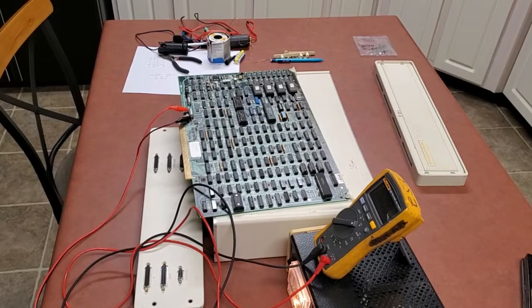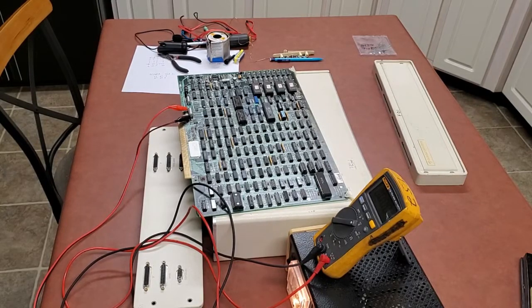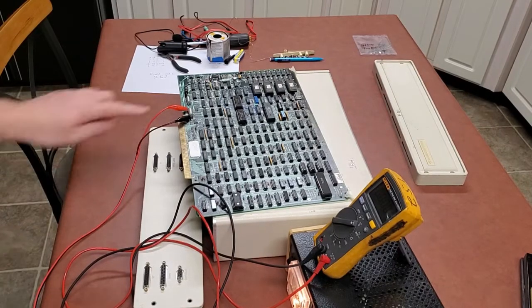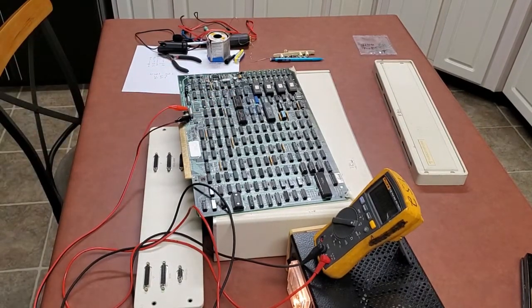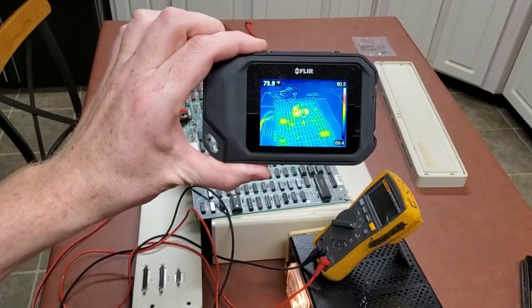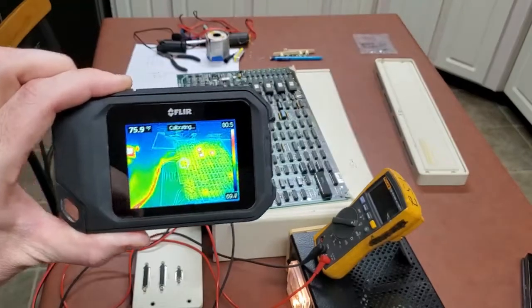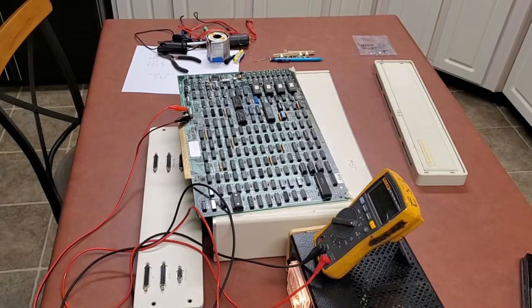I went around a little on the board and didn't see anything else wrong. I was measuring a couple of different places on the board to see if the resistance was lower, and it's pretty consistent all around. So I put about a volt onto the five-volt pins and it was pulling about 100 milliamps. I let it sit for a little while — nothing was getting warm. I slowly turned it up and checked with a thermal camera. The only things really getting warm are these two serial devices, which are powered off five volts. I got it all the way up to five volts and it's only pulling a little over an amp, so maybe it's normal.